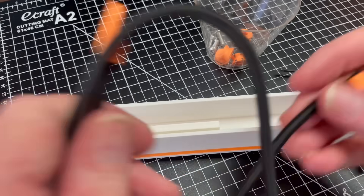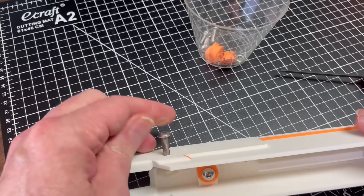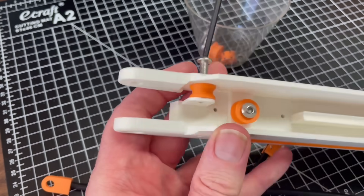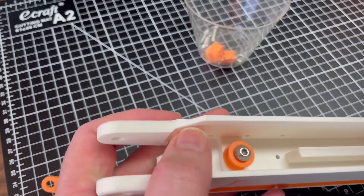It takes about a meter of bungee cord to traverse back and forth between the pulleys. Any length of bungee could produce the same force, but by making the overall cord longer, it meant I could get finer control over changes in tension. Even if changes in configuration altered the length of the cord's path, the tension would remain more consistent.